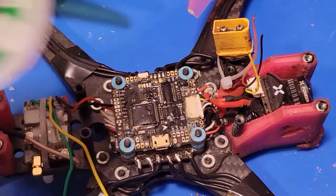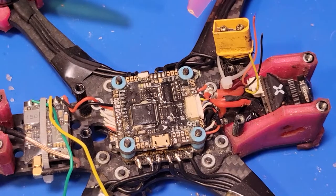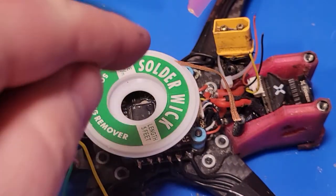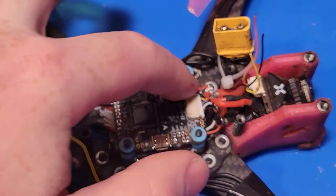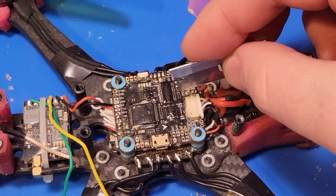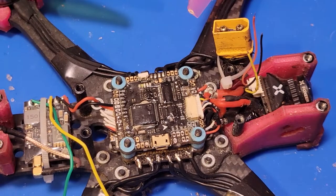The things I'm going to use for this video are solder wick, a razor blade, and a soldering iron. You're going to need solder wick because you're going to want to clean up your solder before you start to melt the glue, because otherwise balls and stuff can get stuck in and around and cause bridging and be left behind. You need a razor blade because what makes it really easy and clean is if you cut out the affected area, and then you need the soldering iron to heat up the glue and get it unstuck.